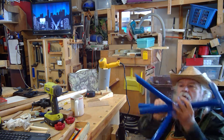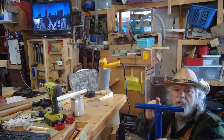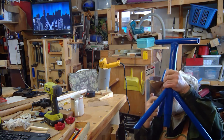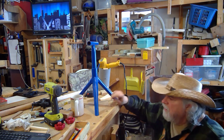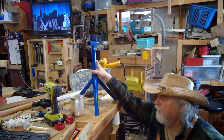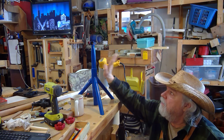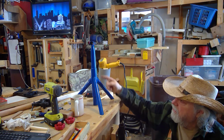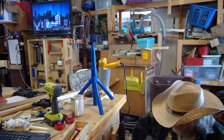It's basically heavy gauge tube in a tube with a third tube here. This is like a 1-inch tube, this is like a 1.25 inch tube, and this one is like a 1.5 inch tube. If you want to know their exact measurements to build your own, let me know and I'll take some quick measurements for you. But if you go out to the material handling suppliers, you can probably find it just like this, and then cut the legs off it and you have this same shaft that this piece is.